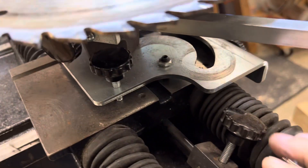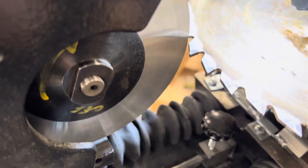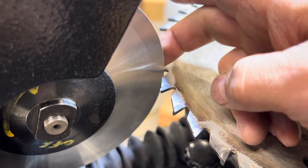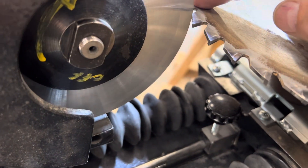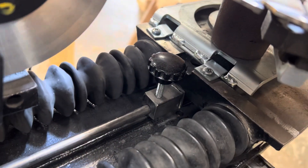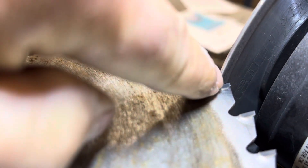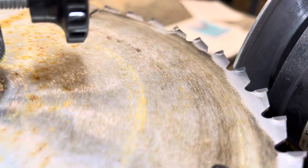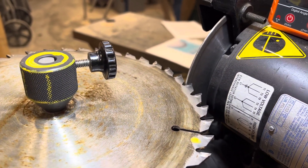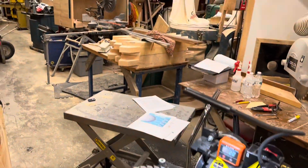How this machine works — you've got a couple stops. This is a back stop here, so when you slide your machine back, if you only want to go back so far. What the important stop is, is in the front here. So when you look at how far you bring your tooth in, you don't want your diamond wheel — and it's only diamond on the back side of the face — you don't want the diamond to come in and sharpen the steel. It's not designed to sharpen steel, it's designed to sharpen the carbide. So what you're going to do is you've got a little set point here. You'll bring it in, touch off, and then you'll set this down so this will only allow it to go in and only hit the carbide. When you look at the wheel, this is all the diamond that sharpens the carbide — only about three-eighths of an inch. I'm going to go do two or three teeth and show you what it looks like.